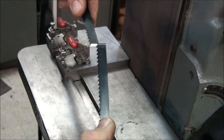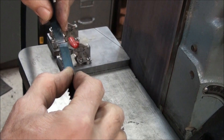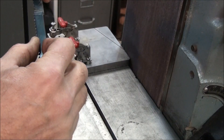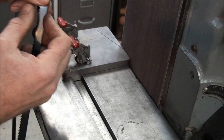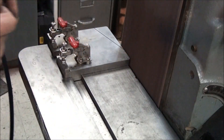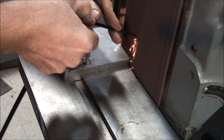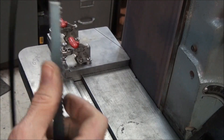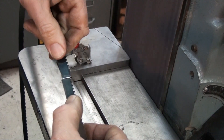You don't need to worry about doing all this stuff on finer pitch blades, only the coarser pitch — this one is six teeth per inch. So you don't need to jump through all these hoops on a finer blade; just grind the taper on it and it should be good enough. Now I'm just going to take and remove some of the burrs — make kind of a feather edge on the back side — take that feather edge off and just leave the tapered part on the front where the blades go together.